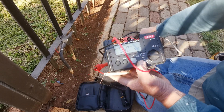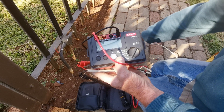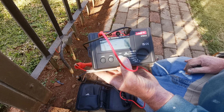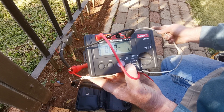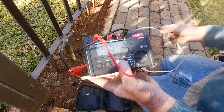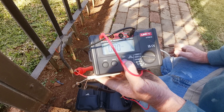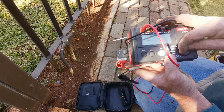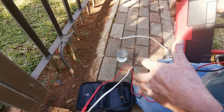Now I'm going to switch it off and take the end — I'm going to put it in this glass of water. That was 5.5 giga ohms before. Back to 500 volts and we test — look at that, zero. It is like this thing is just measuring continuity. Let's take it out, test it again — we've gone back to 5.5 giga ohms. Put it in the water again — water is obviously a conductive resistor. So you can see outside maybe there's a connector or a box that gets water in and it's causing a short. This is a very useful piece of kit.